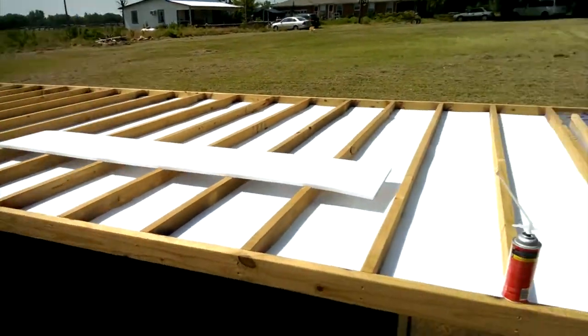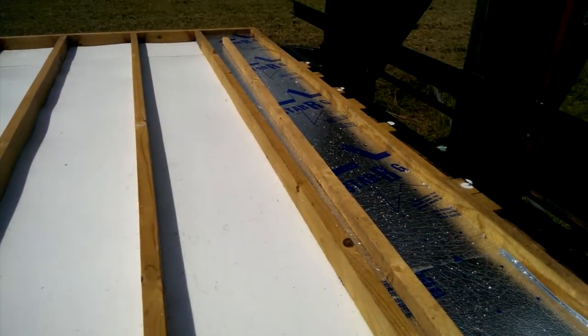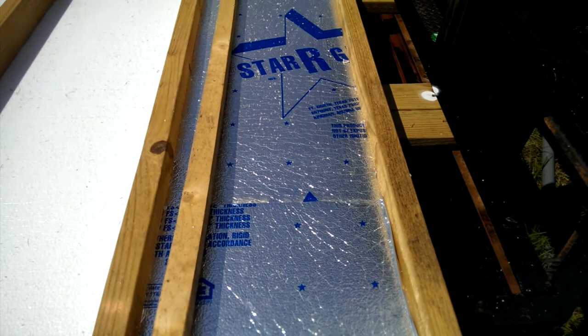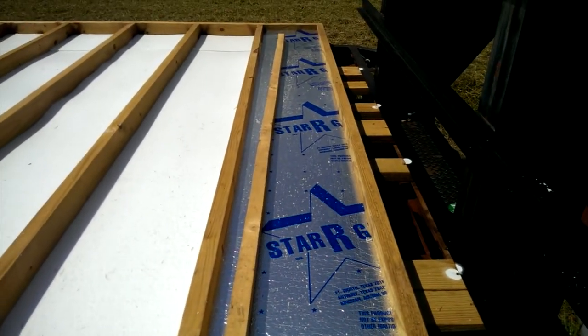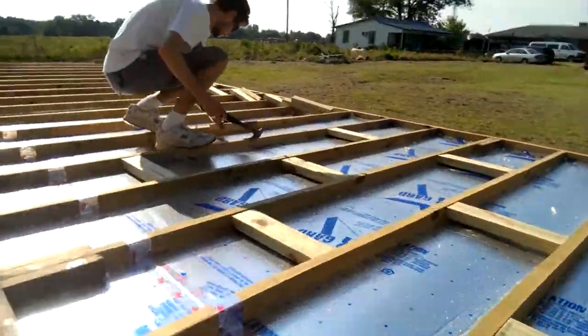David and I are out here putting the foam down. We're putting down one layer with the foil facing down, then coming back and spraying with Great Stuff — whatever kind of foam you want — just along the edges, and then putting down another piece face up, so the foil is up, just piecing together and smushing it down. One thing to mention: when you put the foam down, spray the Great Stuff into it, and then put the other foam down on top, it's going to push out the bottom a little bit. So after you've put that all down, come back after about 3-5 minutes and push up from the bottom, especially along the edges.